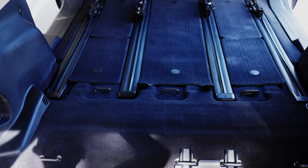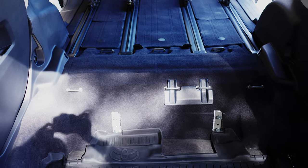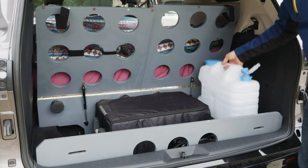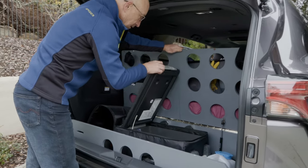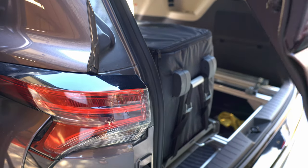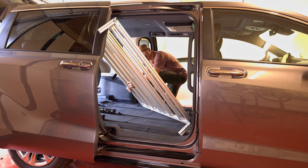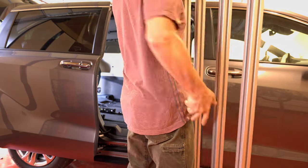From my experience building the first rig, I knew that the seat mounting brackets for the 3rd row seats protruding from the floor are excellent mounting and anchoring points. Designing easy access to our water jug and refrigerator, stored in the 3rd row well in my first build, was the second very important objective. Our refrigerator requires high vertical clearance when opening the lid, so we needed a slider mounted just above the lower edge of the door seal. Third, while I decided not to make the next rig foldable, I wanted to be able to quickly remove it for rare occasions when we need rear seats or extra cargo space from a lumber yard or box store.